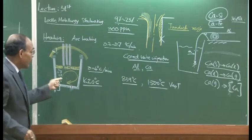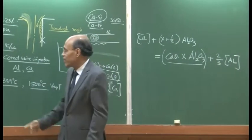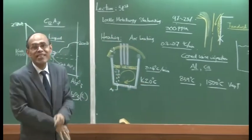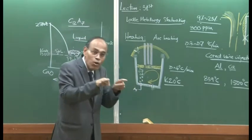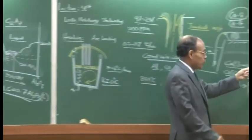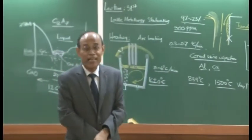And then by the time we finish another 30-40 minutes of operation and go for the final casting step, we have, within plus minus 5 degrees, the temperature of the melt which is desired by the casting shop. So once this is done, the cleanliness of steel is taken into account, but as I said, we will give the ladle time to sit for about 5 to 7 minutes, so that all these liquid reactions which have taken place, the liquid deoxidation products which have formed because of calcium treatment, have enough chance. Holding of the ladle is very, very important for us. Okay? That is very important.